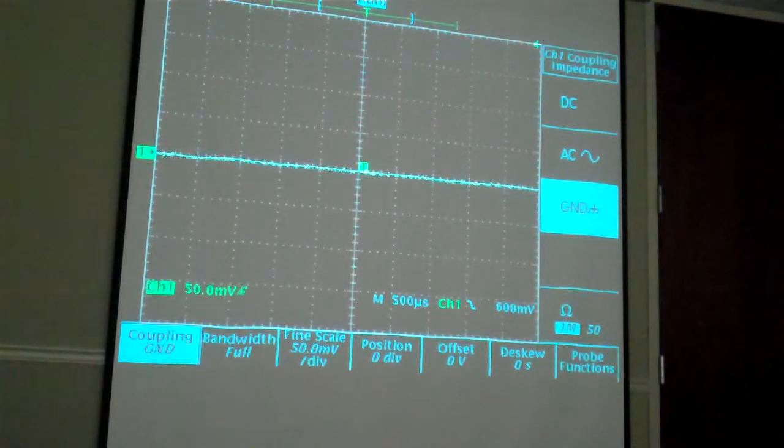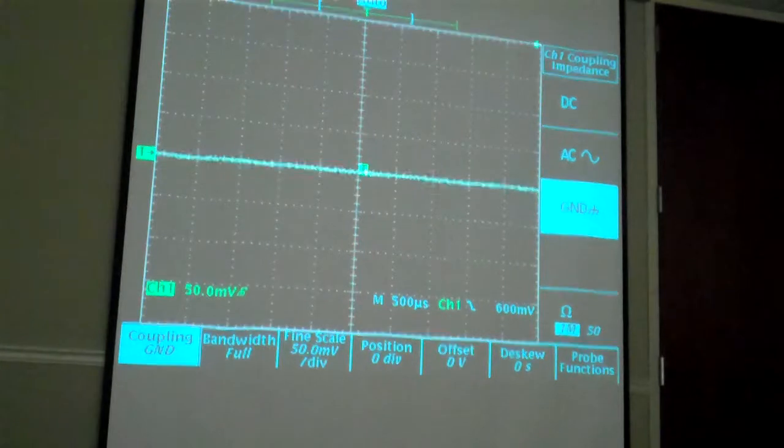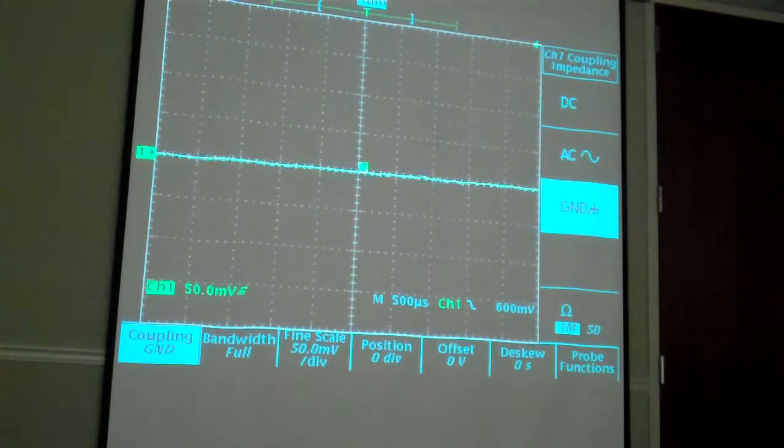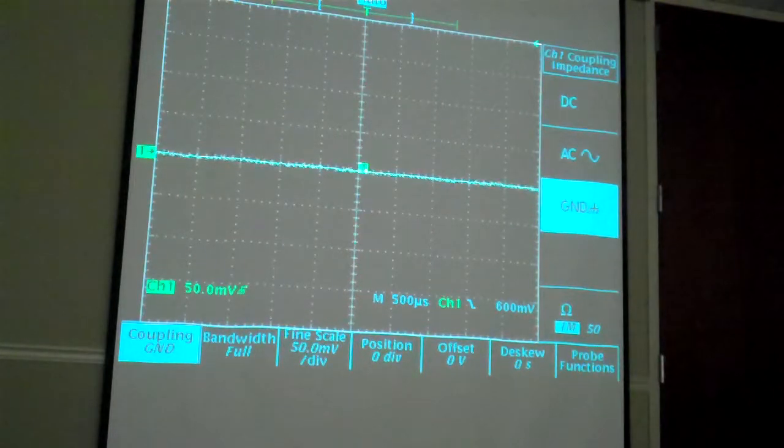Is that two inputs? Does that mean 2 inputs on the scope, or just one input? You can cheat with a scope that can do a plus and minus differential. But it's safer to buy a probe that's designed to be differential and has a battery in it, so that it has its own power supply. They usually have good isolation of up to like 600 volts, so that you don't blow up the ground. So they're naturally safe to the earth ground of your scope.